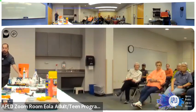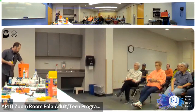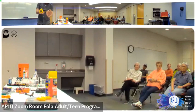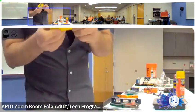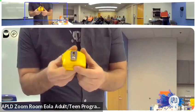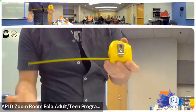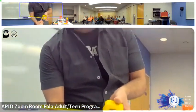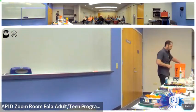Dan, whatever you're showing, can you show a close-up for the people in the room? I can. Somebody is asking. So the quick things we talked about here: one, this little end piece moves just that little bit. The other thing is on the back here, it will show the length of the tape measure from here to here. So when you measure something from the inside, you can just add this number to the number right there. That is weird looking at a fisheye like that.